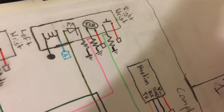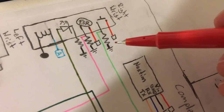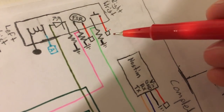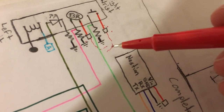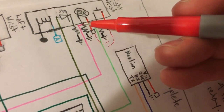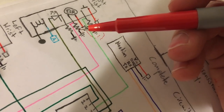Then left button, then right button. I can't even remember my own work. So the FSR goes to the positive, and the button also goes to the positive - they're sharing a positive, connected right there. That is the 5 volts. The FSR connects to the resistor to ground, the button resistor to ground, and they both go to a signal pin. The FSR goes to A2.